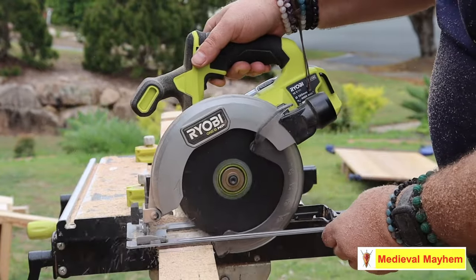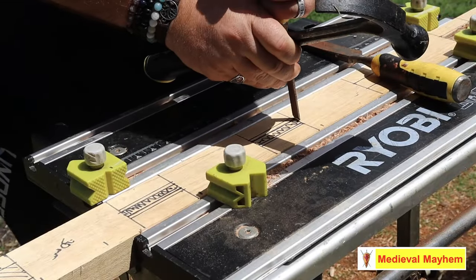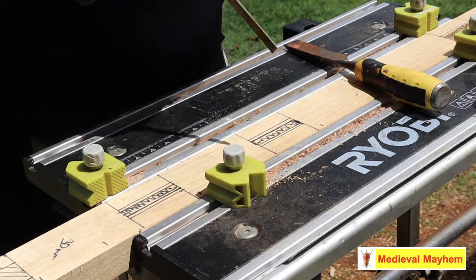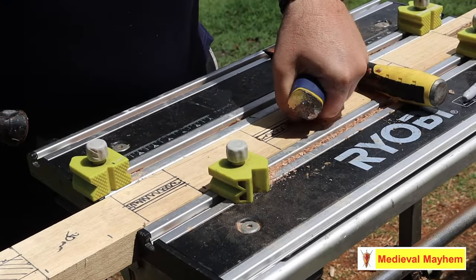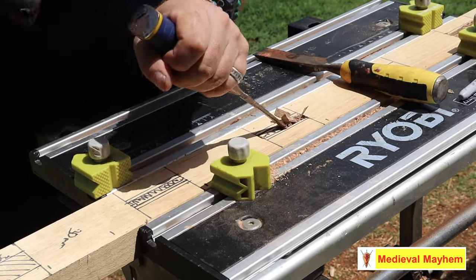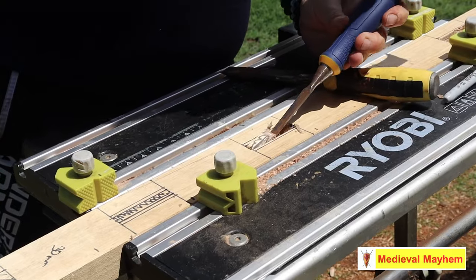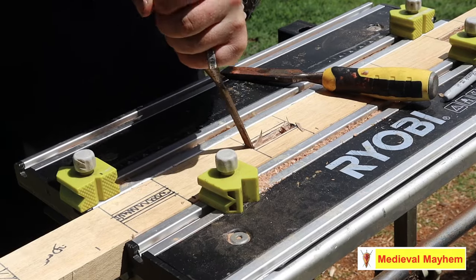For the mortises, I tried a couple of different ways to make these, but I found the easiest, quickest, and simplest way was just hammer and chisel. That sounds a bit old tech — I do like my power tools and I use them a lot — but I found hammer and chisel works really well, very effective and just so quick. You can adjust the depth and get to the right shape that you want. I finished this off with routing and sanding, just to give a nicer shape and finish.